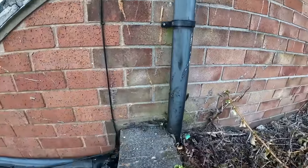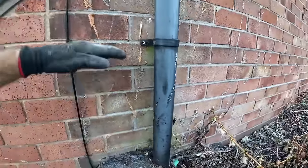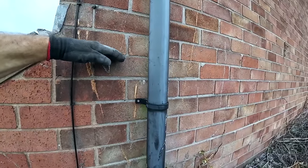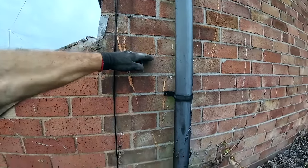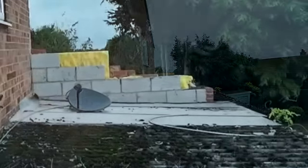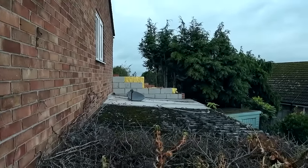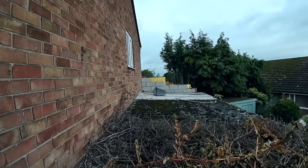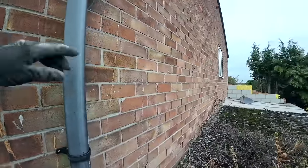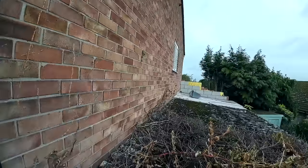At the very least, chop it off, so we can get in here with our steel and our brickwork, which is going up to that one, that's our height, so that's top of our brickwork, down to, well, basically mirroring that, which looks a bit ropey at the moment, but like I said, we can't finish it until we get a roof to pitch it to. The roof is sitting on top of that, and then the top two courses are for the flashing. So the roof comes off, flashing up to the window, all the way across.